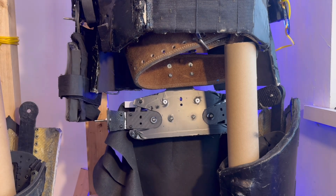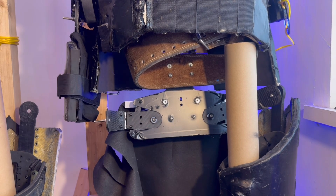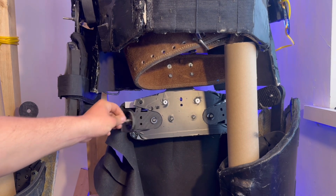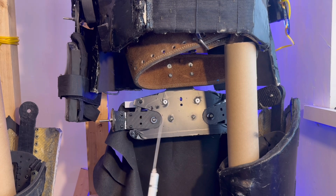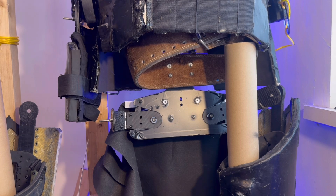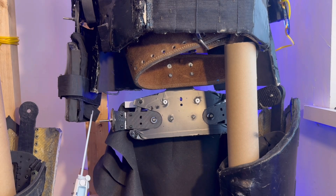This system did work but it was flawed. However there wasn't much point in changing and modifying it to work better because I knew I'd have to move on to the next prototype. One major flaw in this design that needs solving is that you really need some kind of sliding joint on the arm system to allow the leg exoskeleton to basically rotate around the leg, which means the pelvis arms do have to extend and contract.